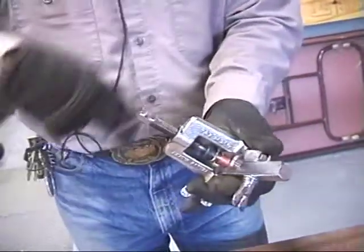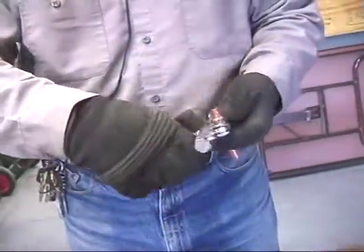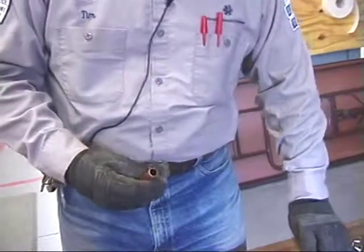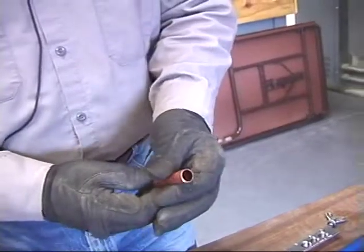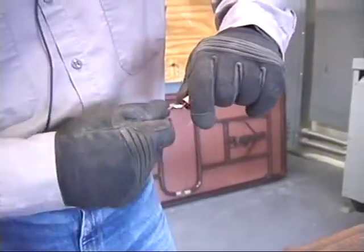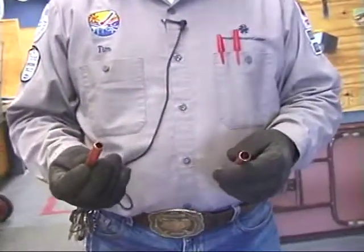Back it off until it comes free from the piece of copper tubing you're working with. Set that aside, unloosen the clamps, and there's your finished product. Now all you have to do is take your reamer, gently turn it upside down, and rotate it to get any excess material out of there that you don't want — you don't have to go deep. Then you have your other piece of copper tubing.